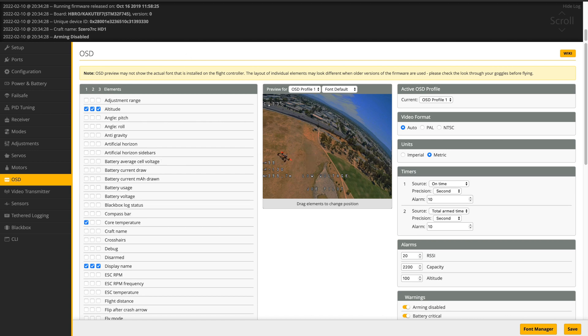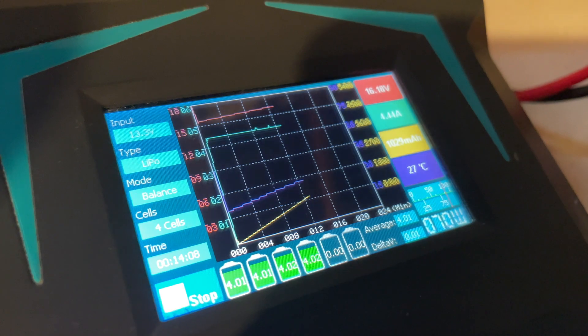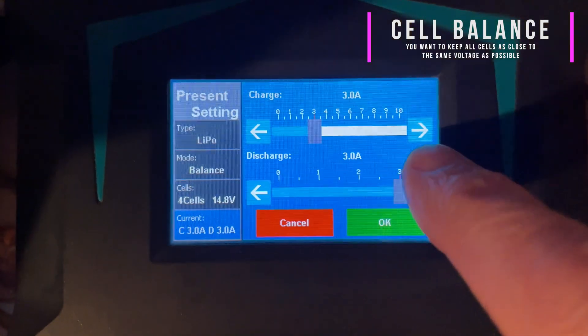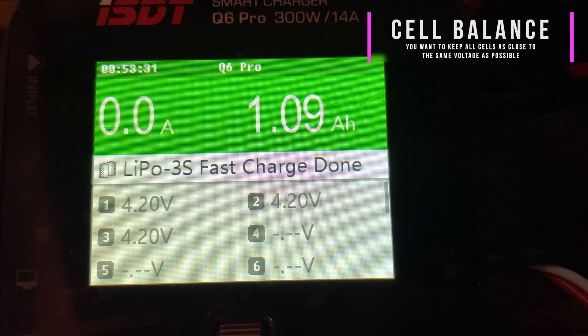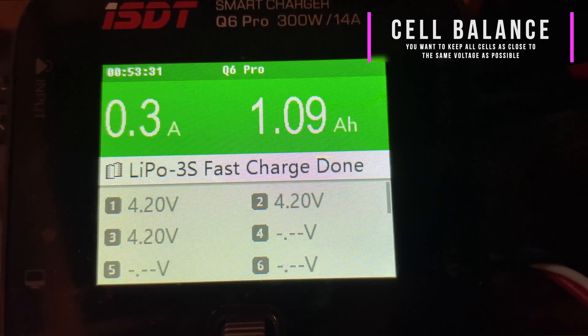It's important to understand the relationship between voltage and cell count. I would also recommend having your on-screen display show the average cell voltage in your FPV goggles. That way it won't matter if you are flying a 4S or a 6S battery — it will show you the average cell voltage, and you'll get used to using that value to decide when to land, not the combined value of all the cells. Any LiPo battery made from more than one individual cell has the potential to have cells become out of balance. Ideally you want all cells in a single battery to be at the same voltage. To help achieve this, your LiPo charger has a charging option called balanced charging. Some chargers will split the charging into fast charging and balanced charging phases, first quickly charging up the cells close to fully charged, then slowly topping them off while checking the voltage of each individual cell to make sure they are all equally charged when finished.